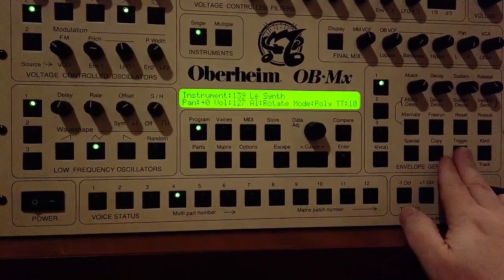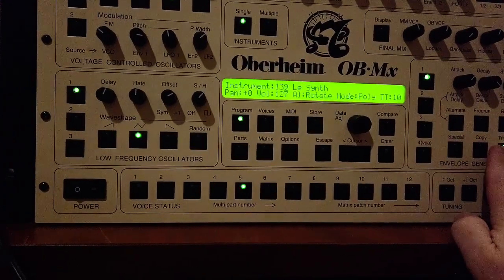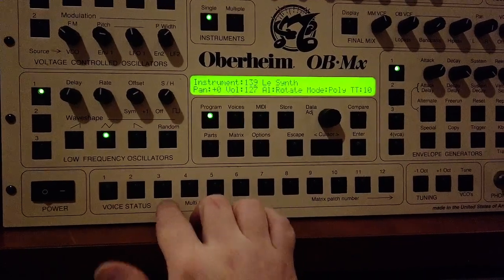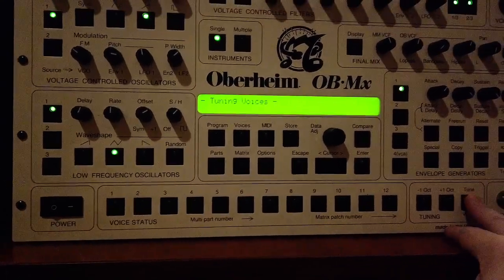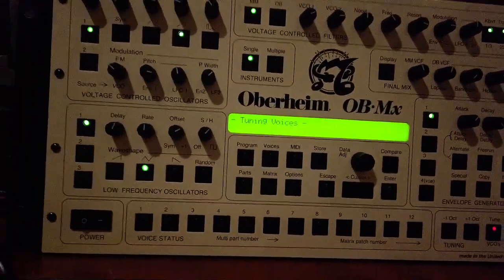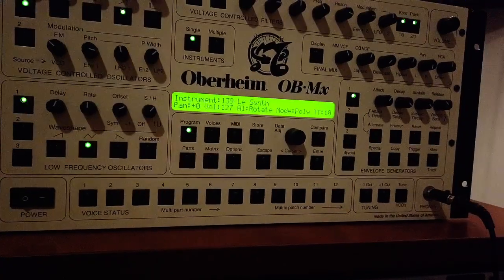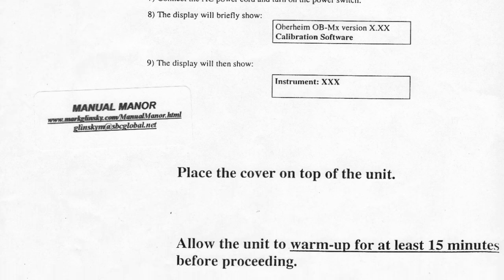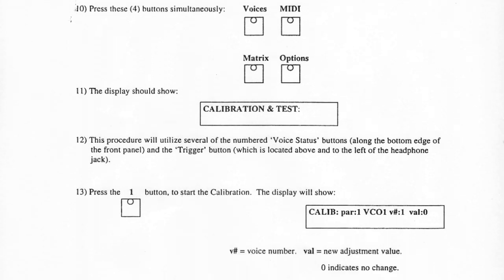I don't have audio hooked up, but when I plugged in the headphones I discovered that all eight voices do work. The problem I've always had is that voice three is way louder than the others - I'm hoping we can run a calibration procedure and fix that. There is a special ROM for the master board that runs through a calibration procedure, and I have access to oscilloscopes and stuff. So maybe we'll have some fun, and I'll see you again.